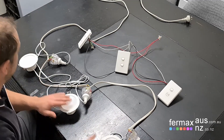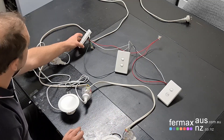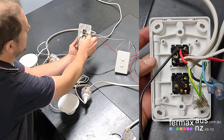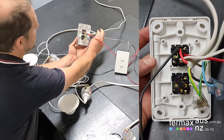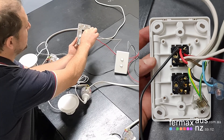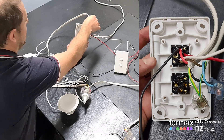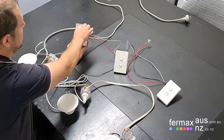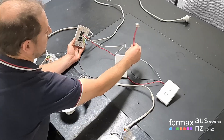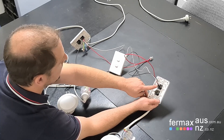So we've got our three lights here, we've got our active, neutral and earth, all daisy chained up. Coming back to our master switch, we've commoned up the earths and the neutrals as well. The active from our power source from the switchboard is wired to terminal number one where we've got our switch wire white connected. In number two we've got our black with our red, which is actually our active from our lights into port number two, and then our common, which is a red wire, that red wire is then looped in and commoned up into switch number two and wired into the common of our final switch.